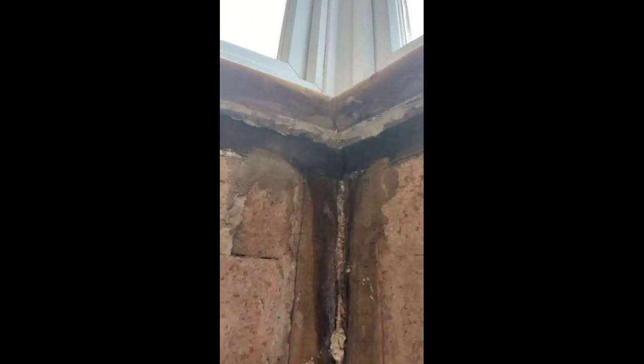One of the things that was exposed, which got us really onto this, was some water ingress coming in here. To identify where it was coming from I did a backtracking exercise and identified that on the outside of this window there's an absolute minutiae hairline crack which is letting the water in. Over the years that wood softened, and what I've done here is given it a coat of wood hardener, which seems to have done the trick.